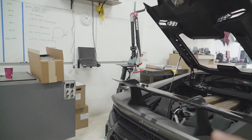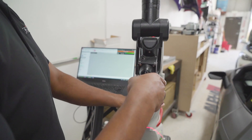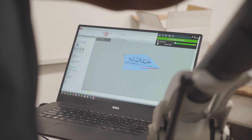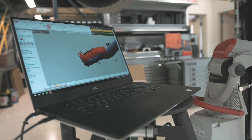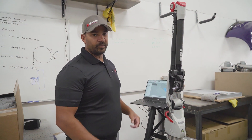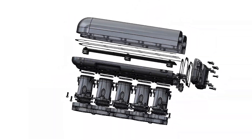With this laser scanner, how is the information relayed from the arm to your software? Basically this little scanner head takes a laser, bounces that light off surfaces, and that turns into simply a bunch of points. We collect all our data on the laptop, then go back to the desktop, process the data into a more solid mesh or surface, and then bring that over to SolidWorks where we do our design work creating the parts for the car.